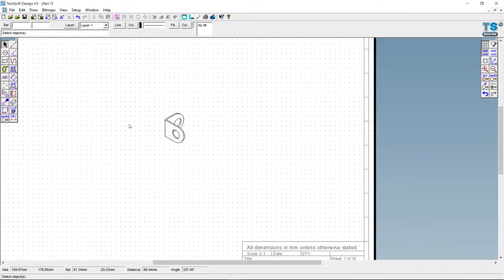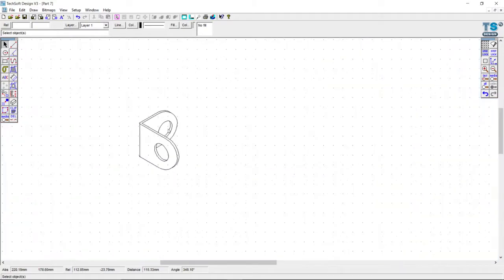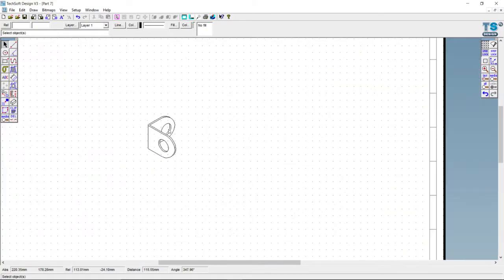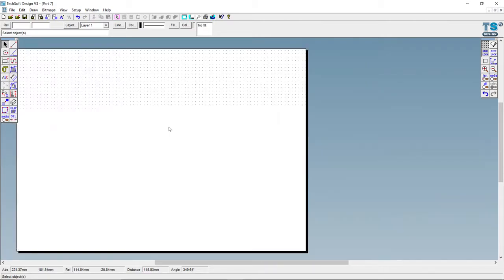So what we'll do today is part number 7 in the series of AB unit 10, and it's a very straightforward 5mm steel, 0.5mm steel angled connector with two 4mm holes in. And I've drawn it this way because that is the way it is orientated in the assembly drawing, so that is how the part will be used. It's not critical, but